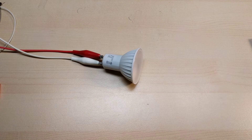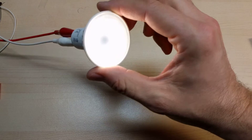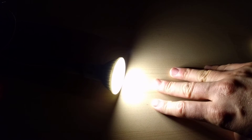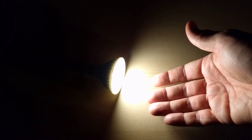But I guess we're going to find out. There could be sparks and an explosion. There we are — so interesting. It actually does light up. Let me turn off these overhead lights here. So that is interesting — there's light coming out of it. Not much, but it's a nice white color and there's no flicker that I can discern. If it's rectified full wave, then we're going to get 120 Hz with a tiny smoothing capacitor, but that's interesting. It's very, very dim — you're not getting much brightness out of this.